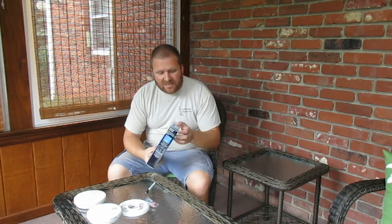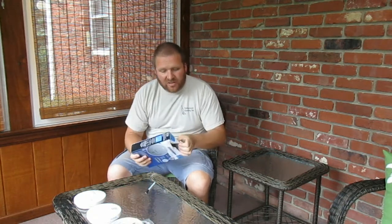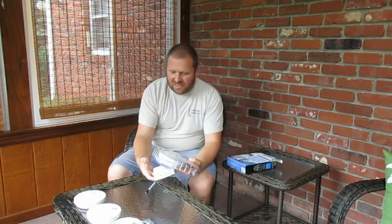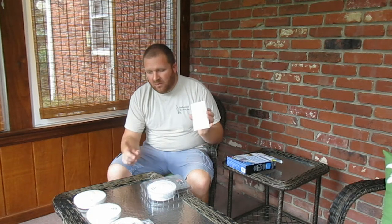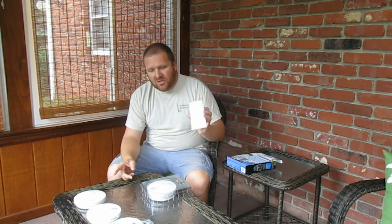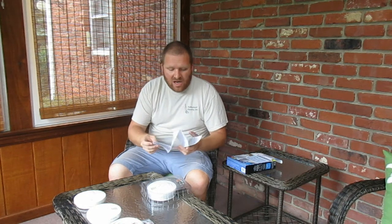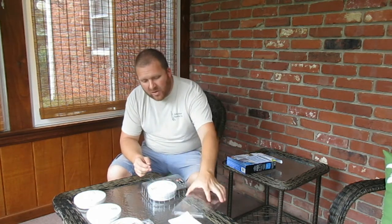So let me pull this kit out real quick and show you what you get in here. I've already done a couple, so I know what I was doing here. When you open these up, you get obviously a set of instructions. These are very important to read through because there are a couple things, and I'll show you them when we do the install. You don't want these closer than 4 inches to the wall because there's dead air there, so in the case of a fire, the smoke doesn't rise in that area first. There are a lot of important things to read in here, so you should read those if you buy one of these. These things are so easy to set up.